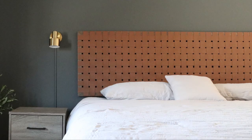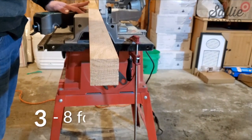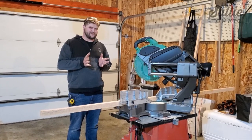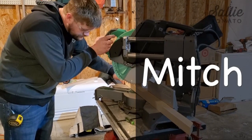The finished size of your headboard will be 25 inches high by the width of your bed. I've created the dimensions for all standard size beds so whatever size bed you have you should be able to follow along and make it custom for you. Now let's dive into the materials you'll need for this project. You'll need three 8-foot 2x2 boards. I've created a blog post with some tips on understanding nominal versus actual dimensions of dimensional lumber. I am a novice when it comes to woodworking so I had my husband Mitch help me, and we chose to go with red oak.